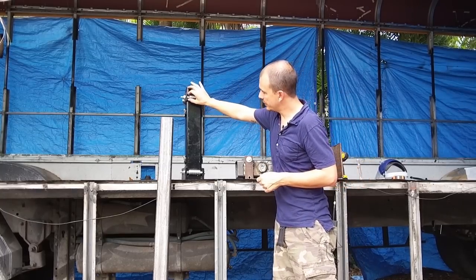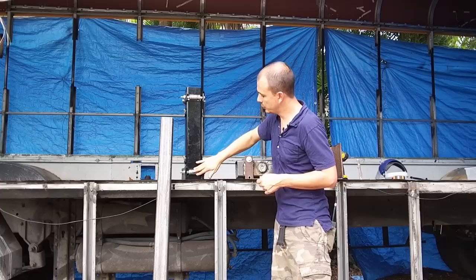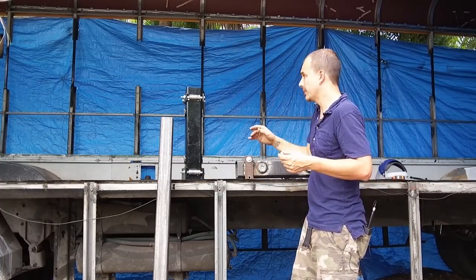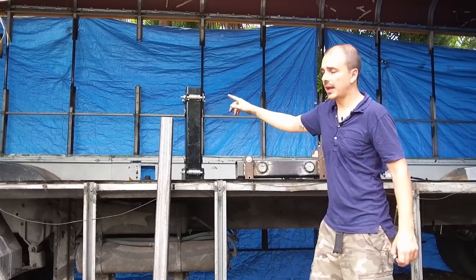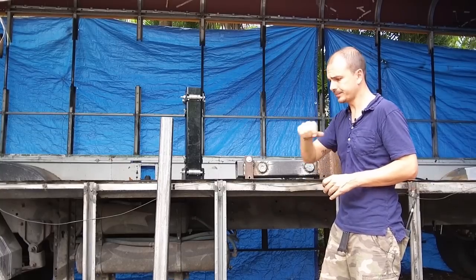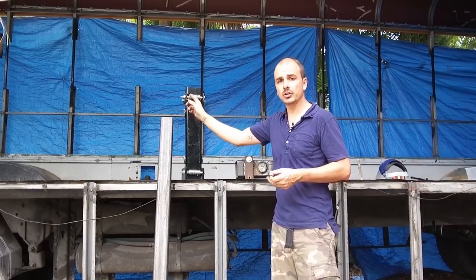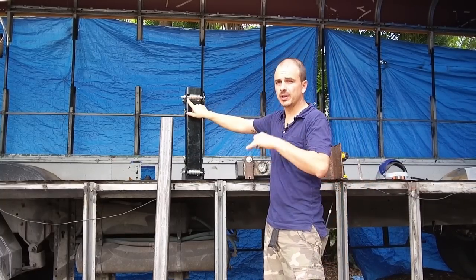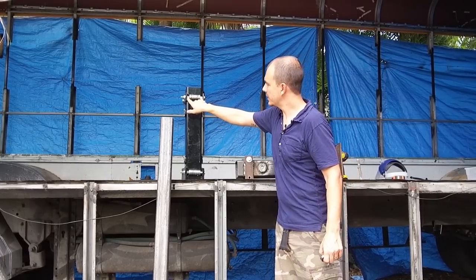These are washers here that I put in the side. The reason I put these washers here was to keep these bearings in the middle, so there wouldn't be too much movement back and forth, and that way they wouldn't get jammed up and messed up. I put these little spacers here that I made out of a half-inch tube steel that I bought at, I don't remember where, I think a local Ace Hardware store around here. It was like maybe $15 for 5 feet of it. I don't remember these measurements, but they're under half an inch, roughly half an inch, to keep it centered.